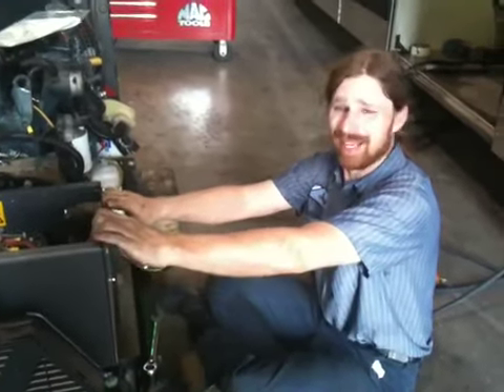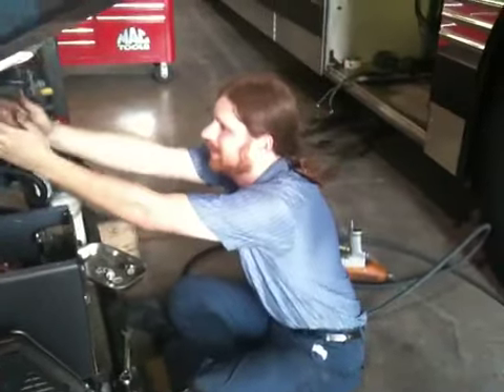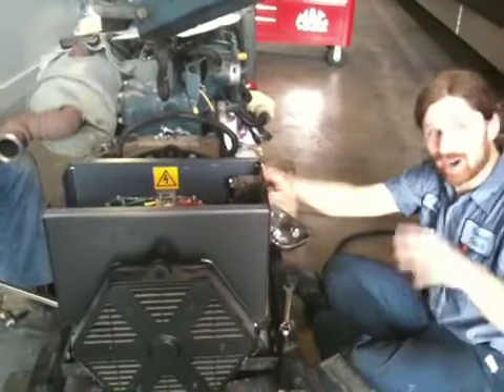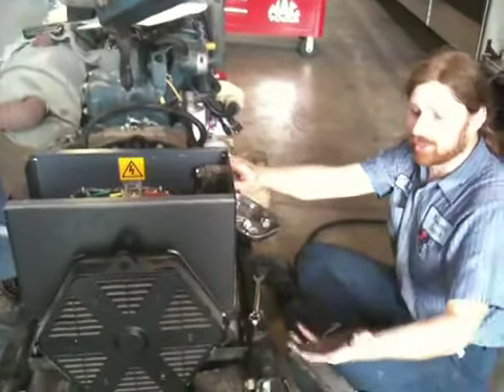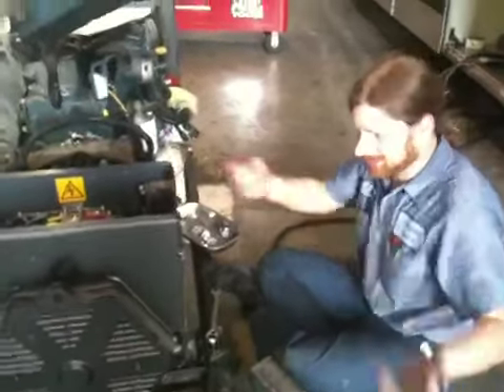To prevent this from happening, when you're washing the generator, please don't wash farther back than the back of the valve cover. Any farther back, we can get water in the generator, especially while it's running. You get water in the generator while it's running, it's like submerging the plug into water — it's going to fry.